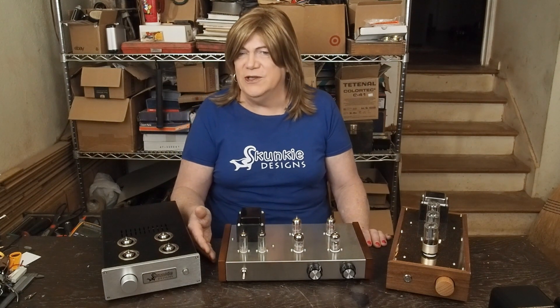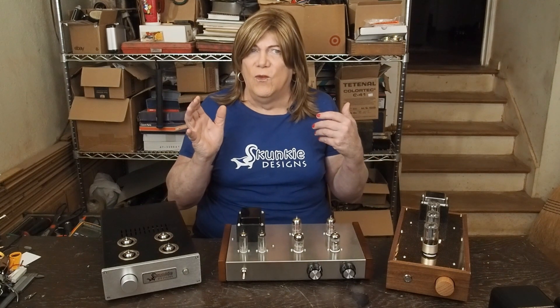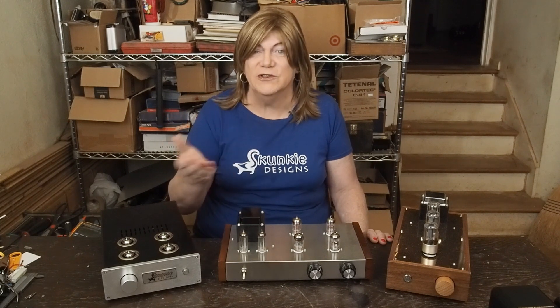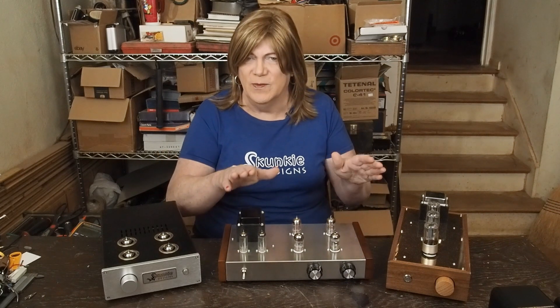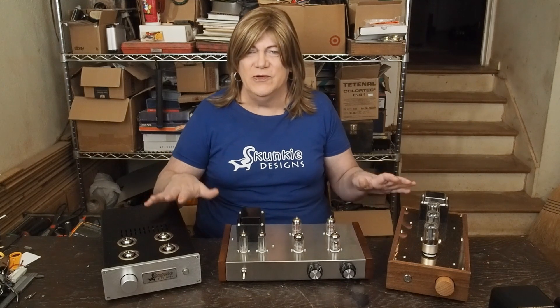So I was talking to my internet pen pal, FLA Charlie on Audio Karma, and he was showing me this little amp that he built. It's called a spud amp. I'm not sure why they call it a spud, but anyway — it's got two output tubes, a power transformer and an output transformer. That's it. There's no volume knob, no driver tubes, and it requires the signal from a preamp to drive it. I thought, what better way to test a preamp than to have an amp with no driver tubes, so we don't have them flavoring the sound? Some 6BQ5 output tubes, which everybody says are just great-sounding tubes. I think this is going to be a fun side project to the shootout — to build this little spud amp.